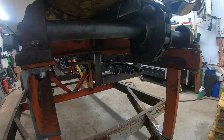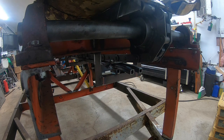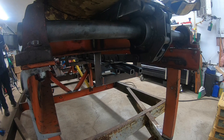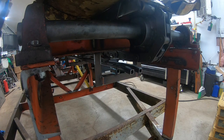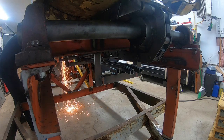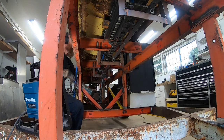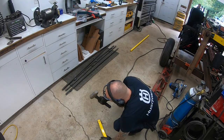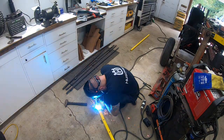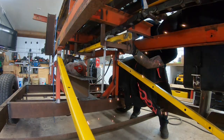I called it a night there, and during the night I decided I had to change the rails for the infeed chain. Some of the teeth were grabbing hold of the sides, I think because of the width I had them at. My original plan for the infeed cleats was to have three teeth — one in the middle and one on each outside. So I decided to change it. Not sure why it was such a huge amount of work, but when it was all said and done the chain felt like it moved better back and forth, so I think it was worth it.